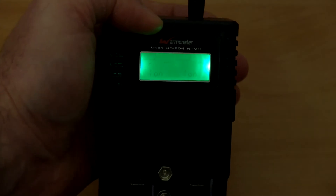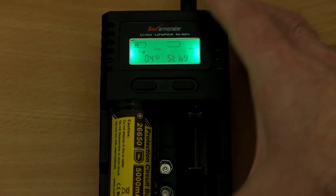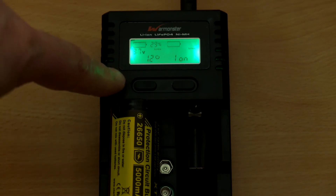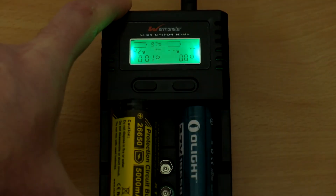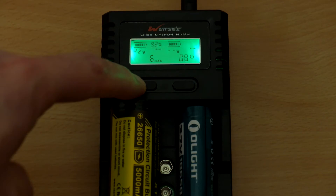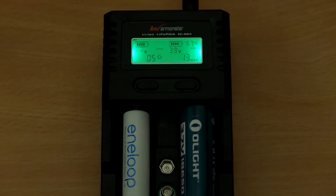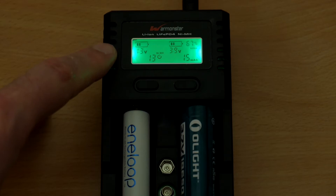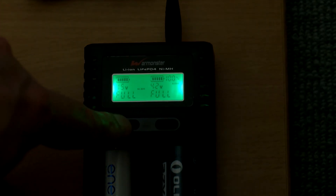That's really all you can do with the display apart from cycling through some of the provided information or turning the backlight on. When you put a battery into the charger you'll see the timer count up, and there's a graph at the top showing the stages of charging. The voltage display is a two-digit display, so you can see the voltage going up on the left. As well as timing how long it takes to charge and showing voltage and a percentage, it also tells you how many milliamp-hours it's put into the battery — not as accurate as a discharge cycle, but useful to know. With a nickel-metal hydride cell inserted, the display changes from lithium-ion to nickel-metal hydride, and when full, both displays show the total charge time and how much capacity has been put into the battery.